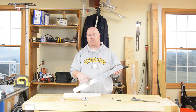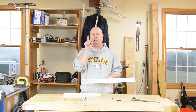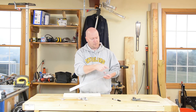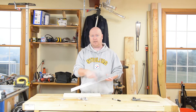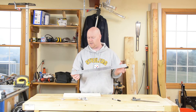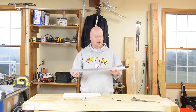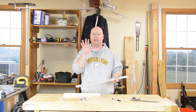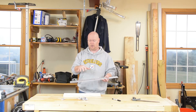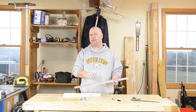I started by marking out a piece of the same two-inch aluminum bar stock that I used to make the bracket that's holding the monitor where I'm currently watching myself, and I marked it out two and a half inches in from each end and then in five-inch increments. It happens to be a 25-inch long piece, so that gives me five evenly spaced switches with enough room that you can get a foot of my size, even maybe wearing an oversized shoe like a hiking boot, in between them and reliably hit one and only one switch.